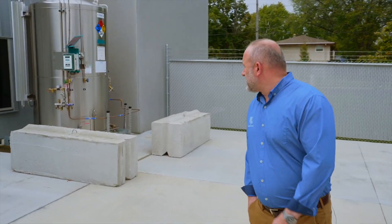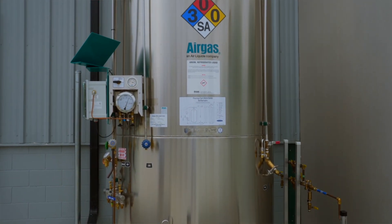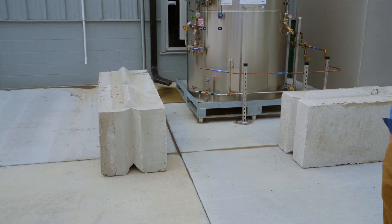We're in our material yard walking toward one of the other requirements for this equipment: a liquid cryogenic argon micro tank which supplies the process gas to the Renishaw machines for their inert atmosphere for welding the SLM build. We had to cooperate with a gas company to purchase and install the tank, and we had to install process piping to get to the equipment. There was also a requirement for vehicular barriers in the extreme off chance that a person would hit the tank, since the tank itself is a little hazardous having so much pressurized gas. The cement slab had to be poured and added to the yard, the fence had to be moved, and a gate had to be installed — it's a safety requirement so people filling the tanks have another means of egress in case of a malfunction.